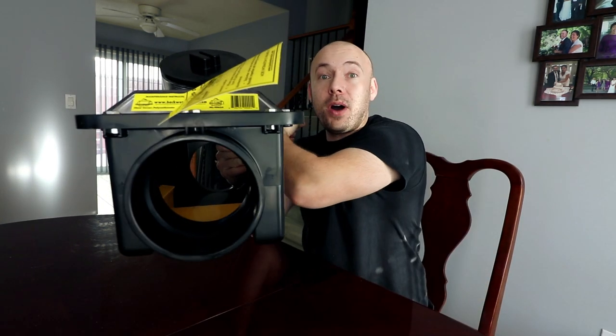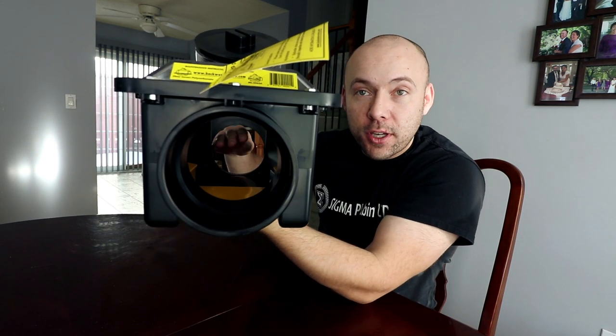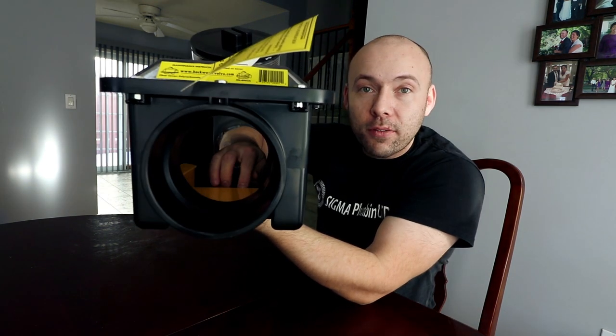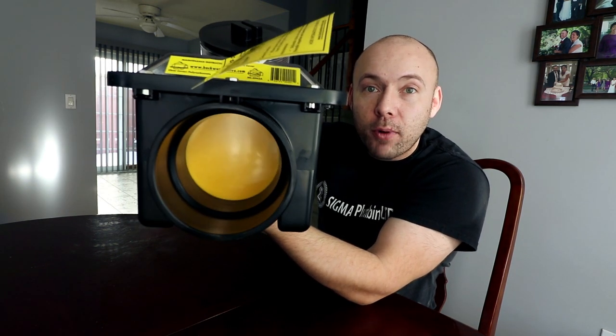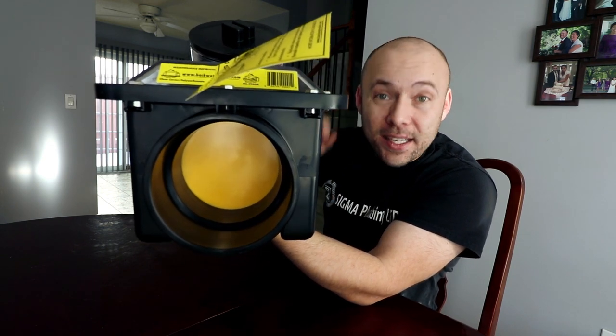It's a one-way valve. And what happens is when flow goes in the appropriate direction of flow, which is towards us, water will touch this valve, it'll open that door, and water will continue to flow out the other way towards the sewer. However, if water starts to come back in the reverse direction of flow, what happens is this door will eventually be pulled back right up to the top and now shut so that water cannot flow back into the house anymore.